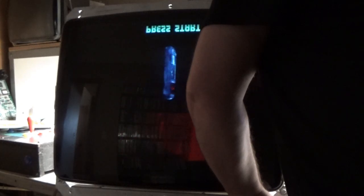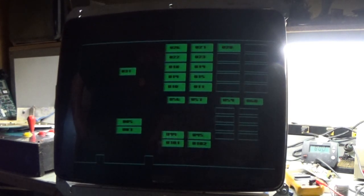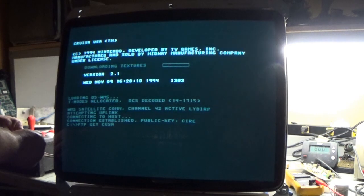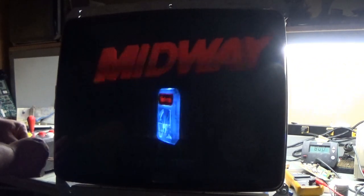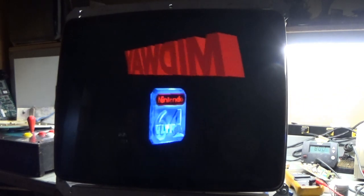Let's turn up our flyback here. If I can, there we go, that'll work. Let me flip the vertical coil here. Okay. Now we're cooking. Okay. Brightness, contrast, H position, vertical position, height. That's pretty good. Right. Nice. That looks sharp. I think the H position's off a bit.